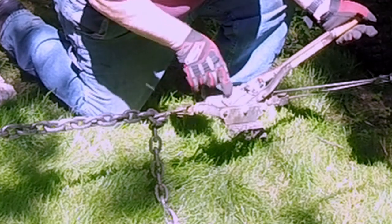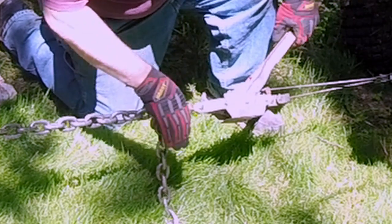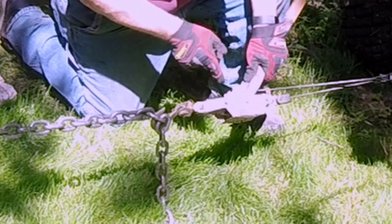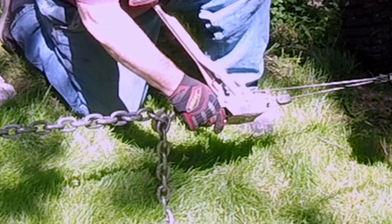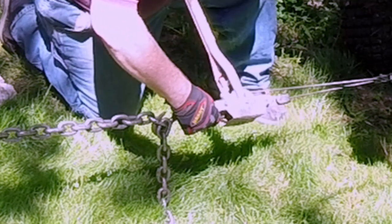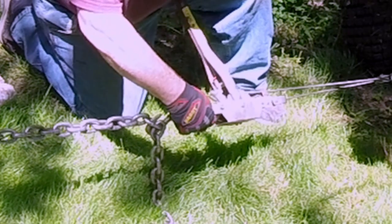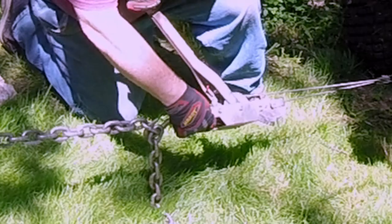So you just have a gear and engaging tooth for the handle, and this releases the engaging tooth. And then there's a little release lever back here. So this handle releases the engaging tooth for the gear. What I've always been taught is you bring it back up and engage it up here, and push forward a little bit so you can pull this gear and let the tension off. And you have to do that a few times to completely detension the system.